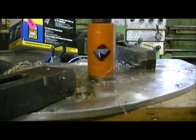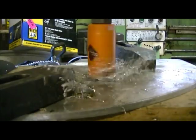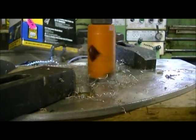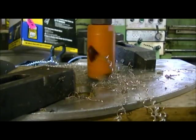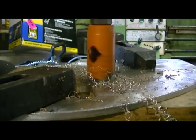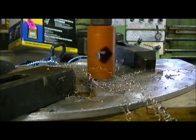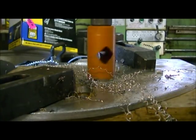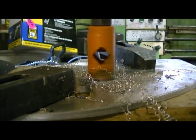So we've got a 1-inch shaft. Bearing, of course, is a 1-inch bore. I'm making a 1 1/8-inch hole. So actually, you know, 1/16 of an inch on each side of the shaft clearance. It doesn't sound like very much maybe, but it should be lots. As long as I did my math right, that is. If I didn't, I guess I got another piece of aluminum that big.